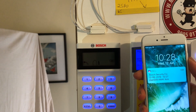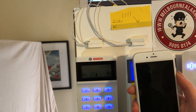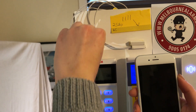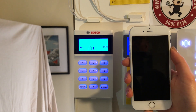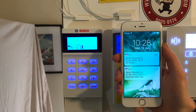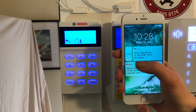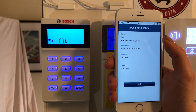From here I'm then going to cause an alarm in the system. Just on top of the code pad here we have a reed switch. This mimics a door being opened. So if I open that now, the system goes into alarm. Once again we have a short delay and then we'll receive another notification. So Bosch Security Company — time and date — we've had an alarm from zone 1. From here we can open it to see our full push notification.